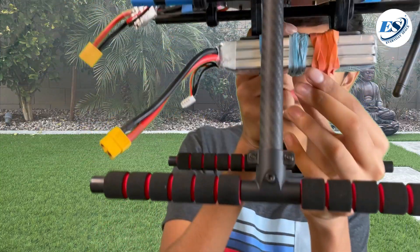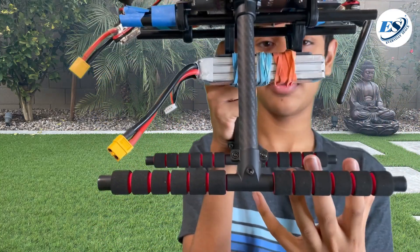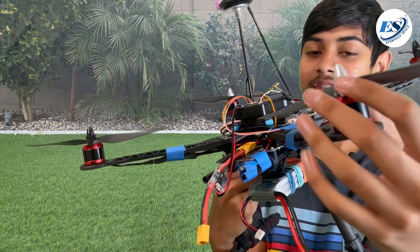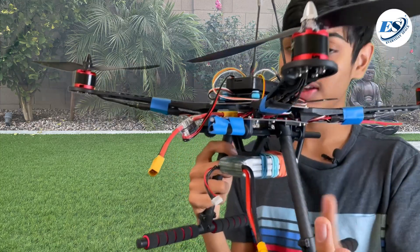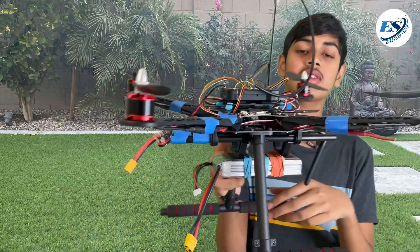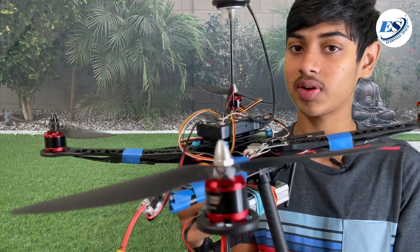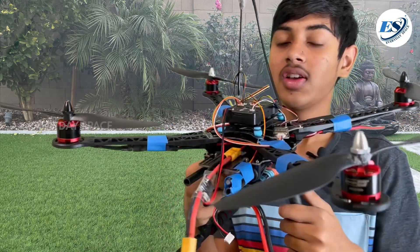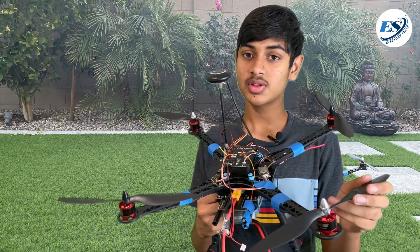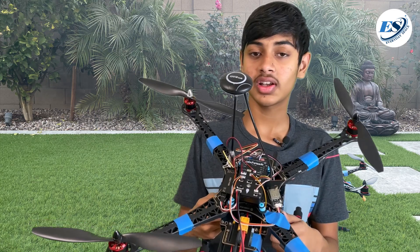As for the rubber bands, I put a lot more rubber bands this time and they're holding up fine, so that wasn't really the problem — it was just that this propeller broke just a tiny bit. In later testing, what would happen is the drone would always tip over and not really get off the ground, because the cracked propeller wasn't producing as much thrust and lift as the other ones. That's it for this video and I'll give you guys an update when I get the new propellers and when I've done some more in-flight testing. Thank you guys for watching and I'll see you next time.